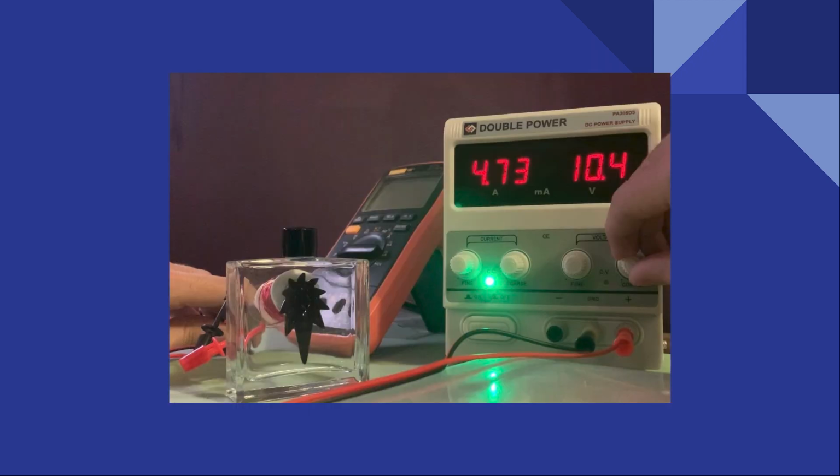The Arduino's digital outputs are connected to the circuit controlling the electromagnet as well as the blue LEDs. These pins output a steady 5 volts in accordance with the data read from the analog inputs.